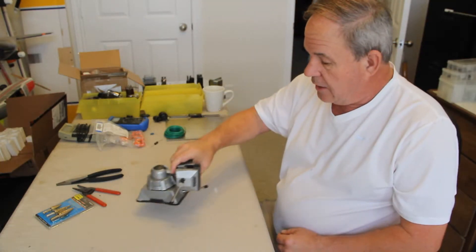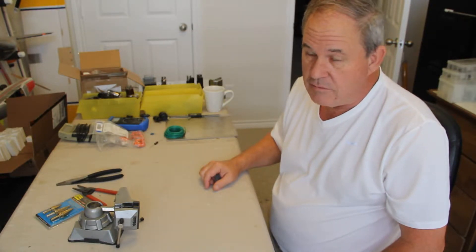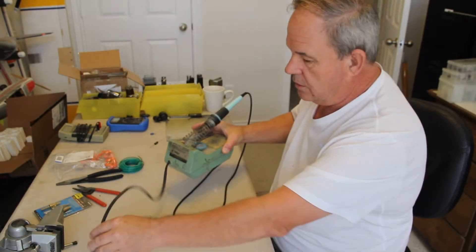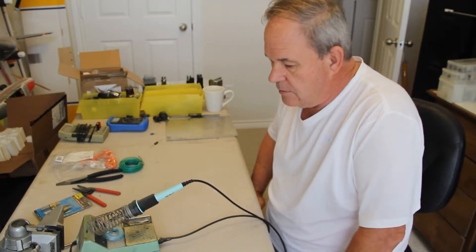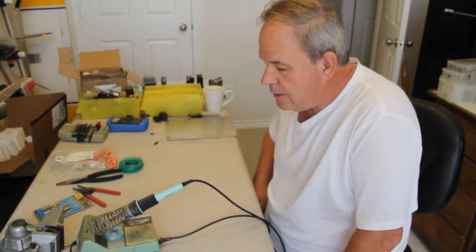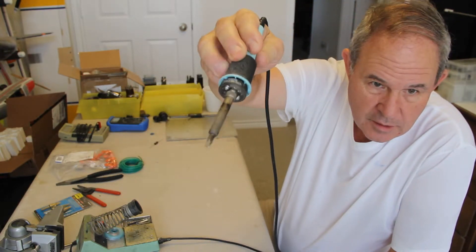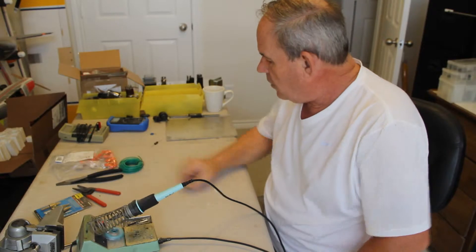Little mini vise — they're pretty handy. I'm going to go over some basic soldering skills right now that should help you and save you a lot of frustration. We'll go ahead and fire up the old soldering iron. This is a Weller. Just turn it on — it takes about 30 seconds to heat up. It's a fairly professional design. It has a wet sponge in there, a spot for carrying your extra tips, which you'll need. I got the big one on there right now.